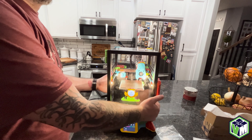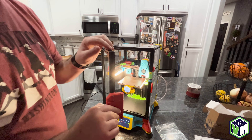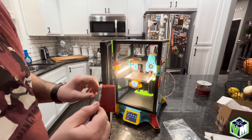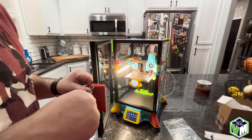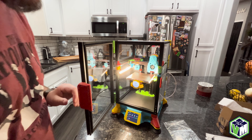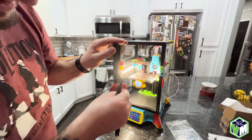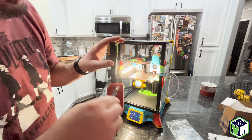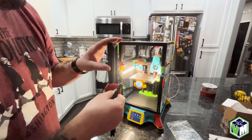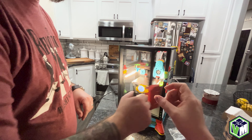One point to note — my wife playing with it here, the awesome camera lady. When this sticks, that's because the upper and lower are too tight. So simply just loosen one of them, usually the top because gravity, bring it up just a hair. Usually it's good to use like a flat head to wedge in there — it's what I usually do. Just barely hold it in there. Tighten that down. Problem solved.